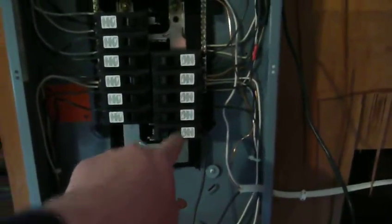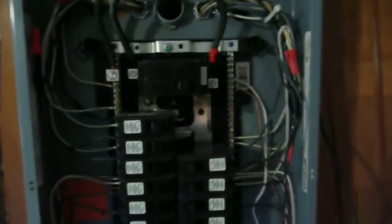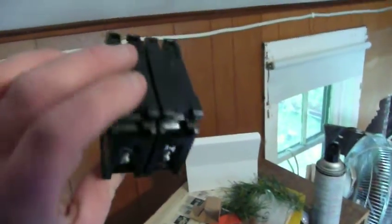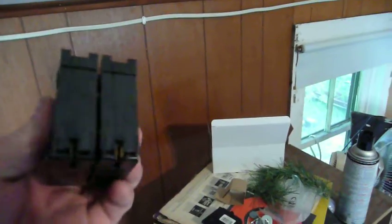The first of many improvements that we made to it was to put it on its own dedicated circuit breaker down there. There are two missing circuit breakers up here because while I was in here, I discovered why at long last this double-wide breaker didn't fit right. It turns out it's completely the wrong breaker for this box, so I've got to get a replacement for that.